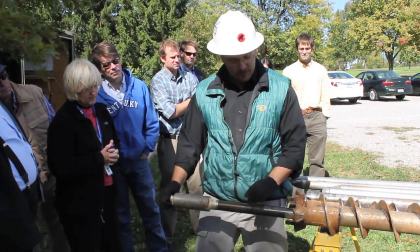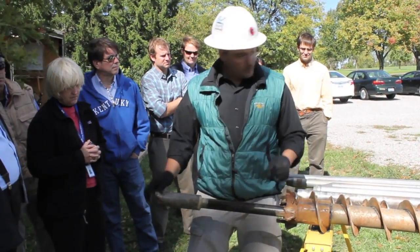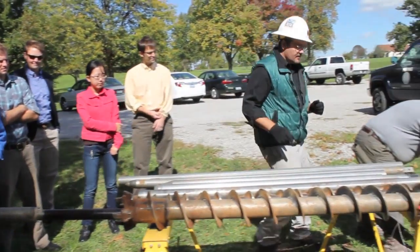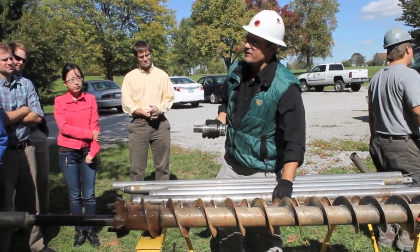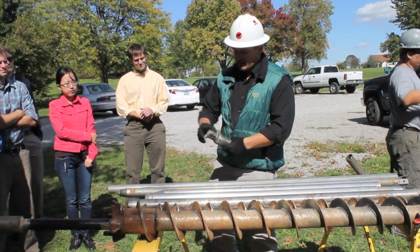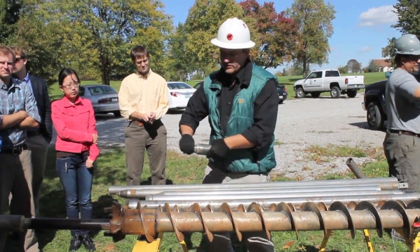The internal auger takes a while. You drill to depth and then we can set PVC to the Gamma Logger. While we auger, we can do a direct push — we put this in the top and push a core barrel while augering, then pull out an inner core. This has a swivel, so while you're rotating, this stays straight so you're not spinning your core, just pushing it straight into the ground.